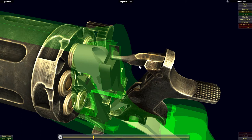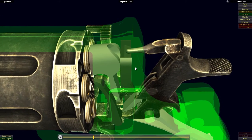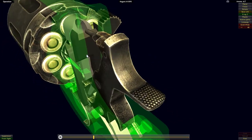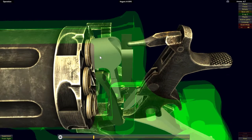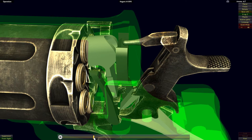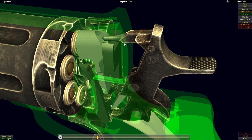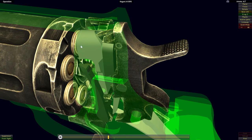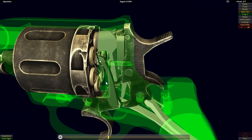This pivoting motion is important because of the pusher. The firing pin comes through and strikes the primer on the base of the cartridge case through a hole in the pusher. Because the pusher moves back and forth, you have to allow some movement in the firing pin — the pusher could be fully to the rear with the hammer down, or fully forward with the hammer down. In either instance the firing pin has to be able to go through that channel, so we have a pivoting firing pin. The sloped surface directs it upwards into the hole, and the firing pin is now within the cavity and has struck the primer on the cartridge, firing it off.